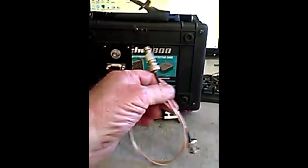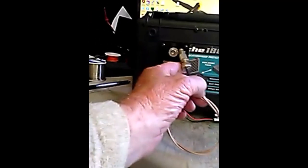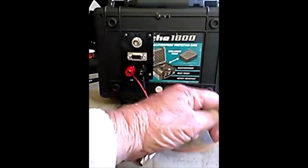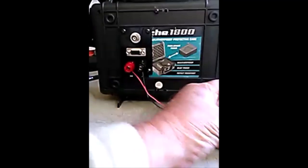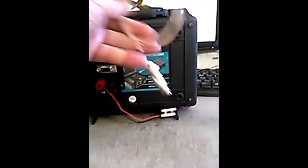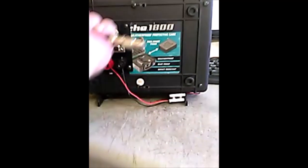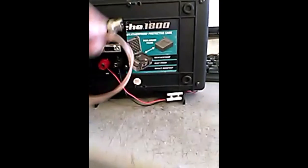This is a cable I got for attaching the main antenna cable to the display unit. The main antenna cable is pretty thick and inflexible, so it might be kind of hard to attach directly. I decided to get a much smaller and more flexible two-foot cable. On one end it's got a BNC plug, and on the other end a BNC female jack. This end will mate with the cable coming down from the antenna, and this end will mate with the BNC on the display unit.